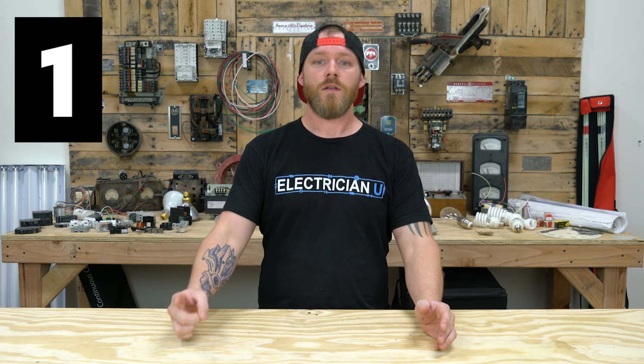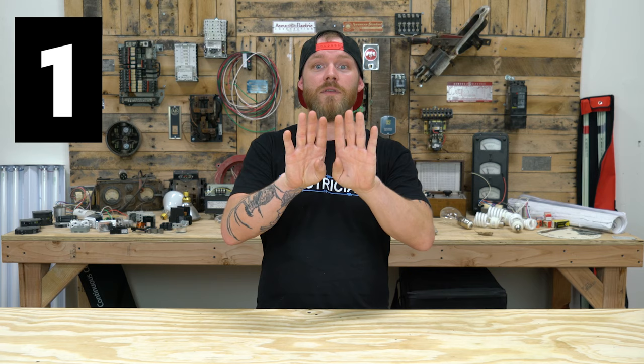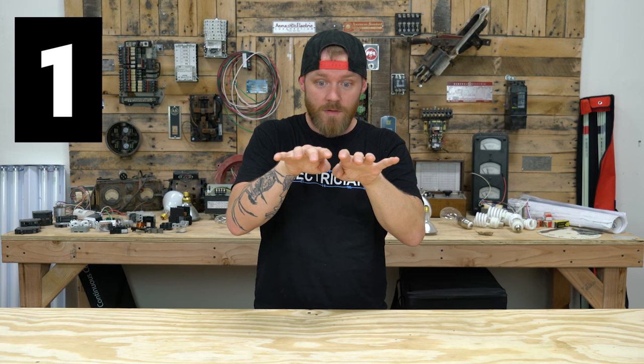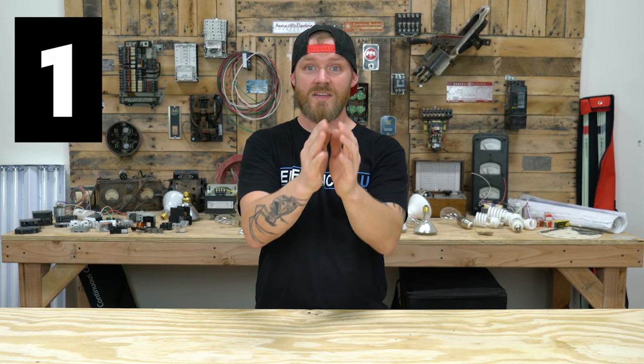Number one is obvious, but always do your work in a neat and workmanlike manner, meaning try to run everything straight and even. Don't decide that you messed a piece up and you're not going to worry about it. Take the time to bend another piece or fix it. Try to run everything very straight, putting a level on everything. I like to put conduit evenly spaced when it's coming out of something. If I've got 10 runs, I'll try to space every single one of those the exact same spacing rather than one here and two here, just spacing them all messed up. It just doesn't look as good. When you space everything perfectly neatly, it's impressive to look at — aesthetically, it just looks great.